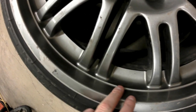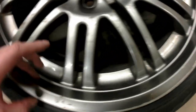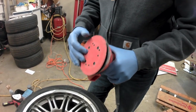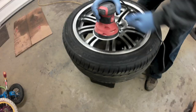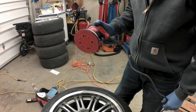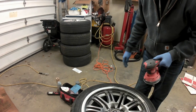One of the things we're going to do is sand down just this outside edge all the way around, then mask it off and try to just touch up the outside. We've got a random orbital sander with 220 grit — the plan is to take off the top coat with the 220, then switch to a finer grit. We'll primer it and then sand with a finer grit.